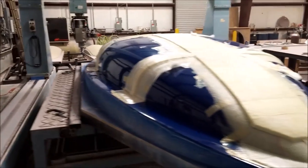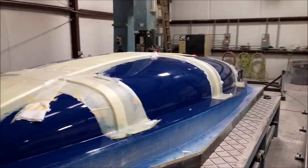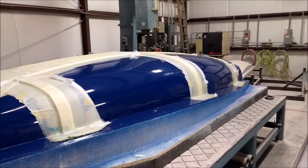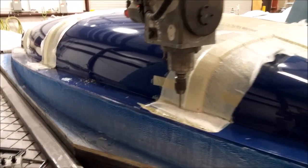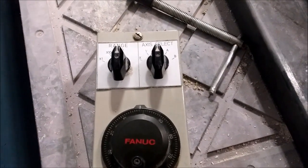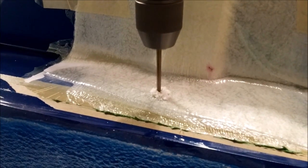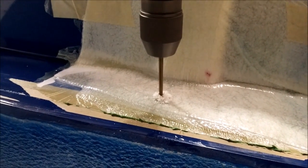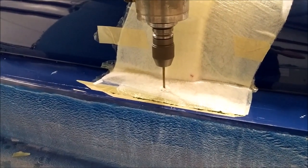Welcome back — here's the update for the first part of the week. The fuselage is back up on the mill and I'm aligning it so I can drill the alignment holes in the cradle we've created. I'm manually drilling the holes after setting the X and Y with the machine, then just dropping the Z manually. You can see it going through and drilling — we have about seven alignment holes that all match up with the jig.